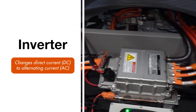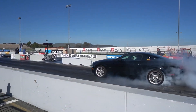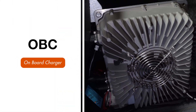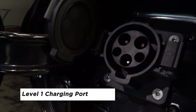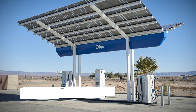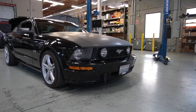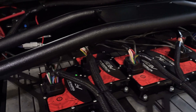The inverter is what drives the AC motor — it takes DC voltage from the battery and converts it to AC. These are in everything from golf carts to larger units that power cars like the Tesla, the Huff Dragster, and the Cobra Jet 1400. An OBC is an onboard charger installed on a vehicle that takes AC from a home outlet or charging station and converts it to DC voltage to charge the battery pack. This is generally called Level 1 or Level 2 charging — a slower type. DC fast charging, or Level 3, is usually found at charging stations, where AC is converted to DC off-board and sent directly to the battery. It requires special communication between the charger and the battery through the BMS to charge at the correct rate.